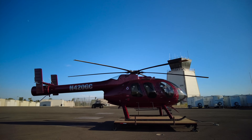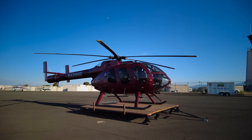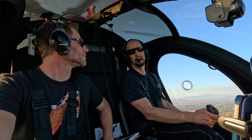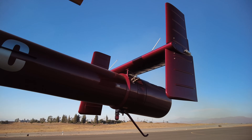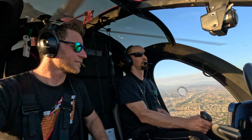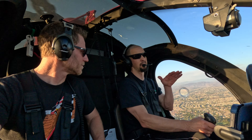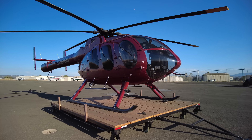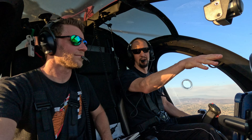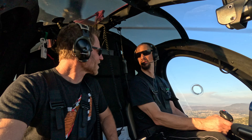The benefit of not having a tail rotor is that if I lose yaw control right now — I have a stuck left or stuck right — I'm going to keep flying until my next airport. All those huge vertical stabilizers are going to keep me straight. Say we have a stuck right pedal: I'm going to maintain about 80 knots into my approach. When I get close to the airport I'm going to slowly, gently de-torque, de-torque, de-torque and come down to a skid, landing at speed. The vertical stabilizers are going to help keep us straight for as long as they can. We're probably going to spin a little bit at the bottom because your natural reaction is to pull power, but you can come down to a skid — so you're not auto-rotating down.